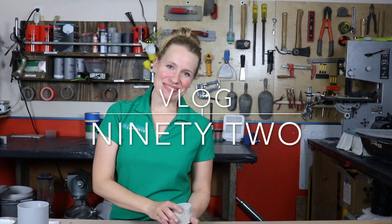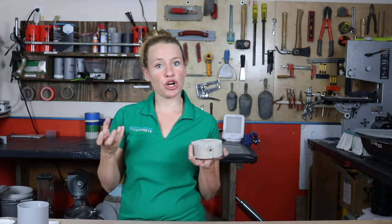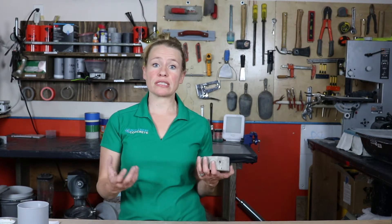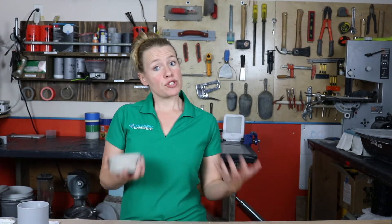Hi, I am Whitney and today I am going to be talking about ASTM C1585, which is wicking or rate of absorption. For rate of absorption, we're trying to see how much water the concrete is taking in. That is important because generally the denser, stronger, and more durable the concrete, the less water it's going to pull in. When it's taking in water, a lot of times it's also taking in salts and other things that can actually break the concrete apart. So it's important to know how much water it's going to take in because we're estimating that durability factor, or one parameter of that.